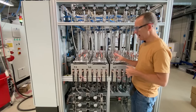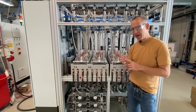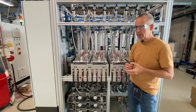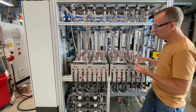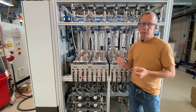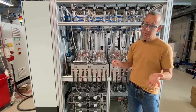One of the particularly attractive aspects of this unit is that the reaction itself is actually done in a glass vial, which is septum sealed and pressure equilibrated. What that means is the actual material inside never actually comes into contact with the metallic reactors, and that means we don't have to design everything in expensive alloys like Hastelloy, reducing delivery times, reducing price, and basically reducing the cleaning to almost zero at the end.